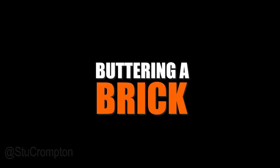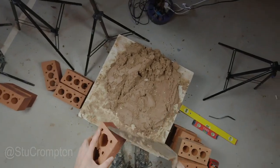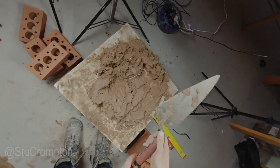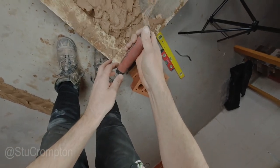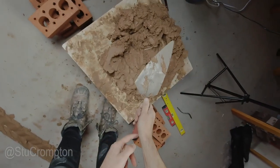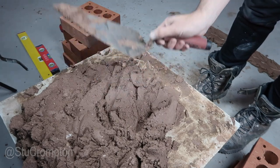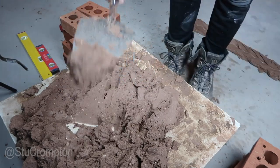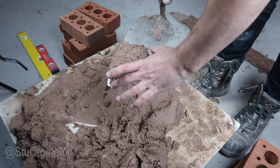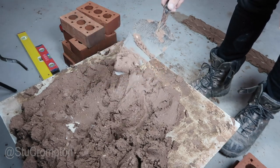So now we're going to butter a brick. The main goal of buttering the brick is to get a full joint — that's all it is; there's no need for any voids in it. When you're taking some mortar, you need to flick your trowel like that so there's a gap, and when you come down your hand just hits — your palm of your hand. That's what a flick is. You want it dropping off in that top portion, top third or whatever. You don't want too much on, and on the flip side, that's too little — you want it in between.